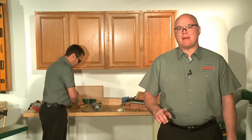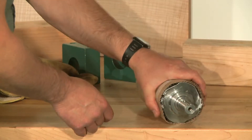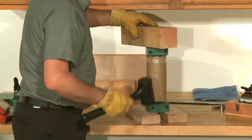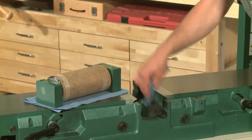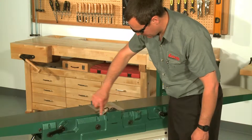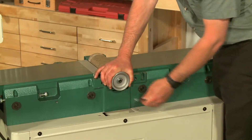Now we are ready to install the new cutter head. The first thing you want to do is wrap a layer of cardboard around it to protect the inserts from getting chipped. Install the new bearings in the bearing blocks. Then stand the cutter head upright between the two 10-inch 2x4 blocks and gently seat the cutter head into the bearing blocks with a block of wood and a dead blow hammer. Wipe down the casting where the bearing blocks will rest and then carefully set the assembly into place. Reinstall the block cap screws and the pulley onto the cutter head shaft. Make sure everything is tight and then remove the cardboard.